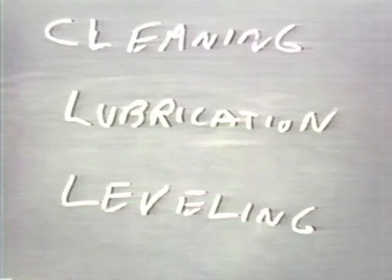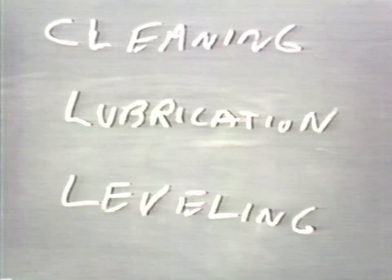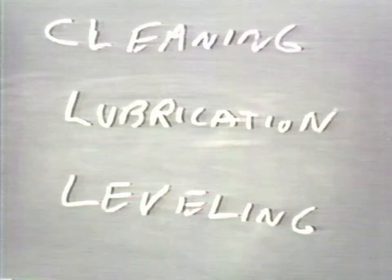Regular lubrication should not be performed on the balance. All of the bearings are pre-lubricated, and fittings which are visible should not have additional grease or oil applied to them. For all practical purposes, the balance is lubricated for life, and the addition of additional lubricants could conceivably cause difficulty by the application in the wrong parts of the instrument.